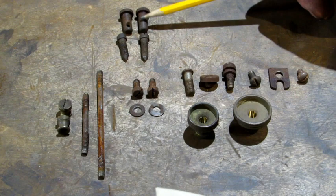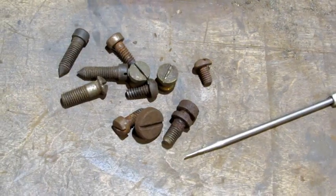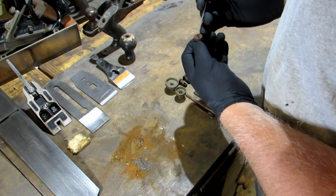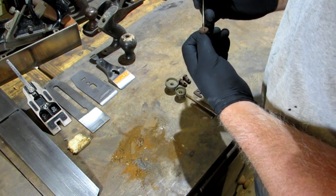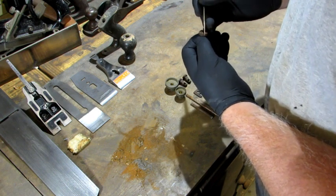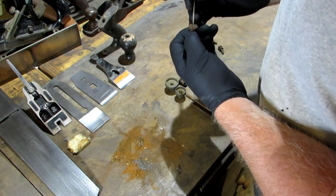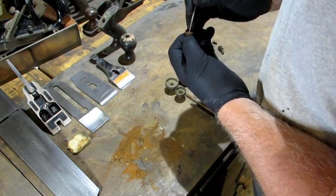The first thing I'm going to do is separate out everything that's got a screw slot and clean them up with a dental pick. This will give you a good excuse to go see your dentist — they're always leaving stuff unattended, that's your chance. Of course I'm kidding. I bought mine off eBay. You want to take that dental pick and get into the screw slots and clean out as much rust as you can, focusing on those tight corners down inside the bottom of the screw slot.